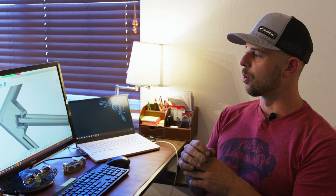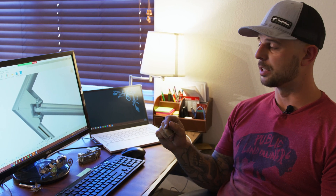SendCutSend has got a really cool new thing — we can order templates from them, just like I normally cut them on my personal laser. They now offer hardboard, which is the traditional one I use — more of a darker wood — or cardboard, which is like a thin stock cardboard, like a cereal box thickness. We're going to go ahead and order hardboard templates to test out that service from SendCutSend and see how it looks. What that's going to enable us to do is I can actually bolt this entire assembly together with that hardboard, pretend like it's metal, and make sure everything looks good clearance-wise. The cardboard ones are really good for checking hole patterns and overall templates, but not necessarily as great for a structural type template like the hardboard is. So now let's save the DXFs and put them into SendCutSend's website, choose that hardboard material, and get those templates in the mail so we can check this design. Then we'll go to metal.